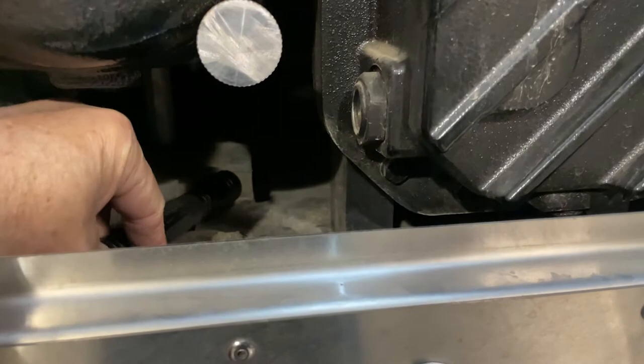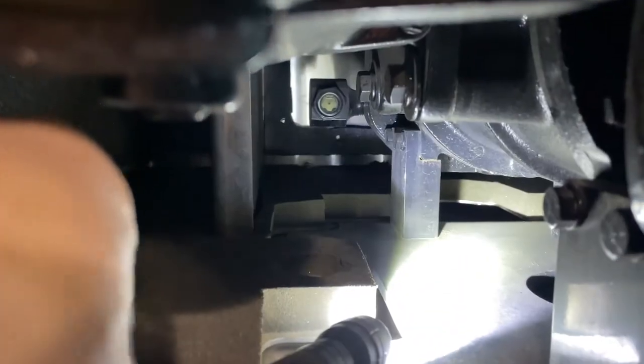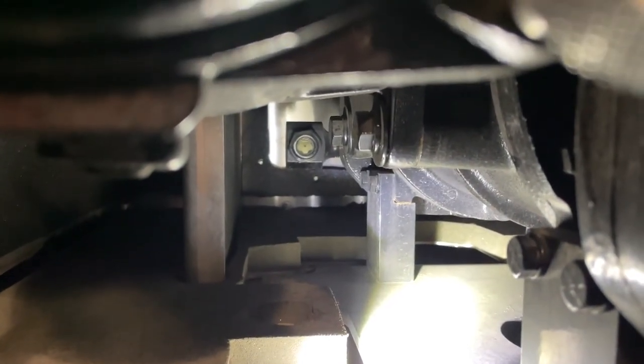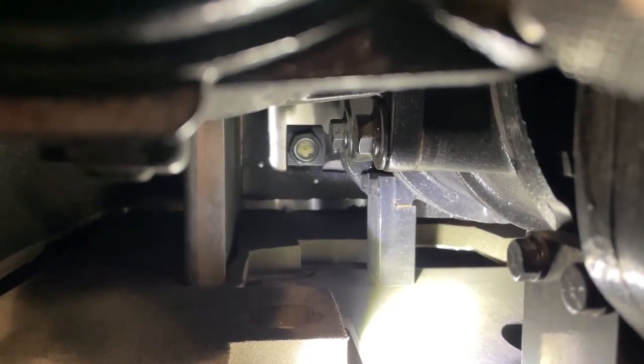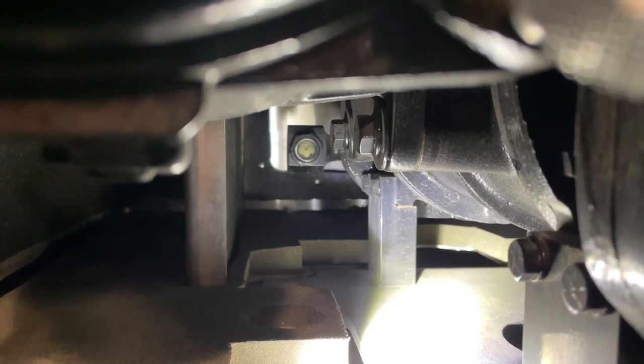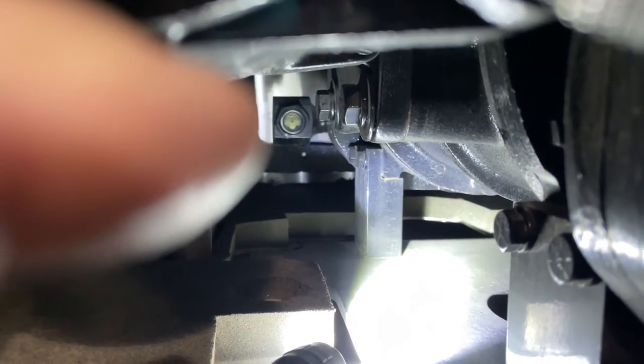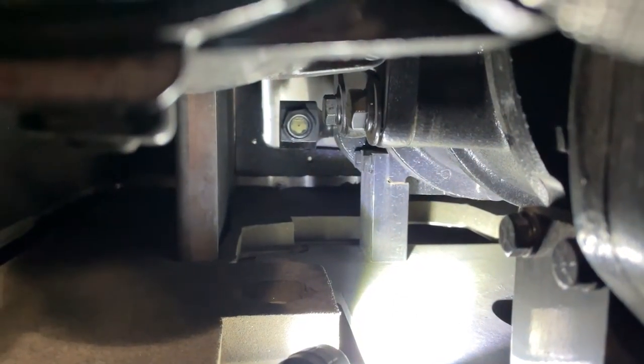When you check the front sump, we'll go ahead and turn the flashlight on. When you look in there, you're going to see the oil level sight glass on the front sump. There's a 90-degree elbow there with an oil level sight glass looking right at you. When you look at that, you should see the oil level in the very center — you can see it right there, the oil level is at the center of that sight glass.